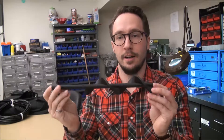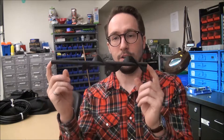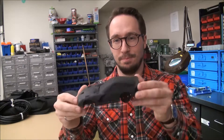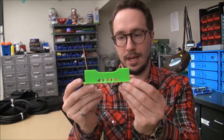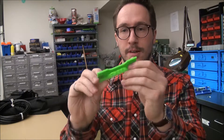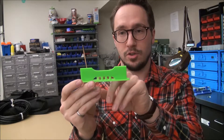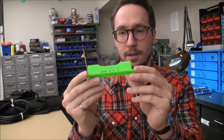There's also orientation. There are a lot of ways to print things — as I was showing you with the auger, there are a lot of ways to print it, and the way this one was printed was standing up, which is actually a problem. You can also print it sideways. Even the Viper here, you can print it at an angle, upside down, just about any way you like. This dog bone was printed on its side — it could have been printed flat or vertical, but we chose this orientation as part of our research project. To print it this way, we had to put in the support structure and use a raft, otherwise it would warp.